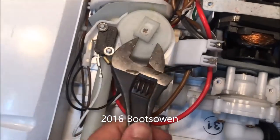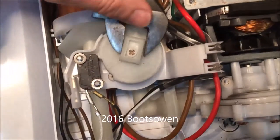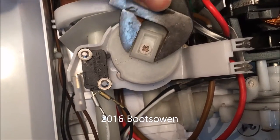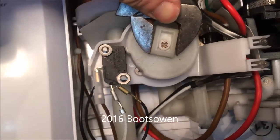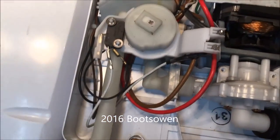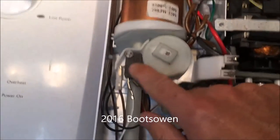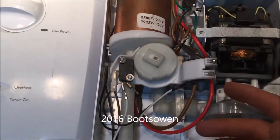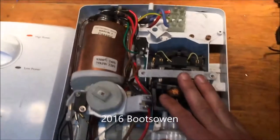It clicks. That's off, with the micro switch here — the little black tab sticking out. You turn it around to 10, click, and all the way around the power comes on. What this does is it regulates the flow — it starts off by turning it on and then regulates the flow through the pump. More flow means cooler water. It's very simple. That's how electric power showers work.